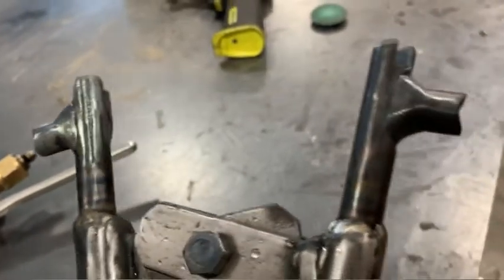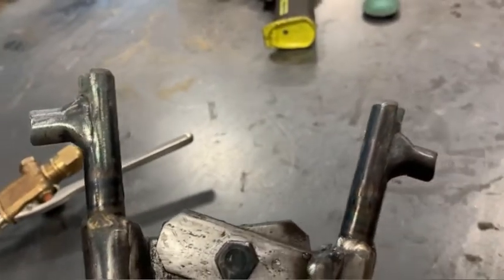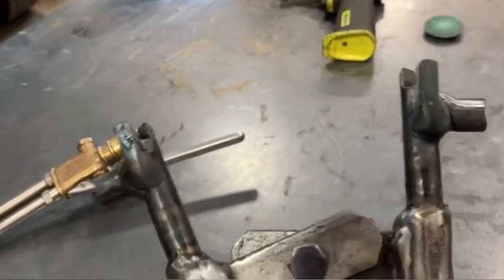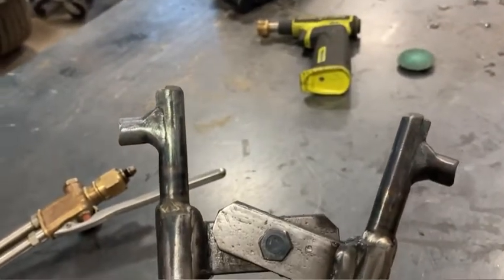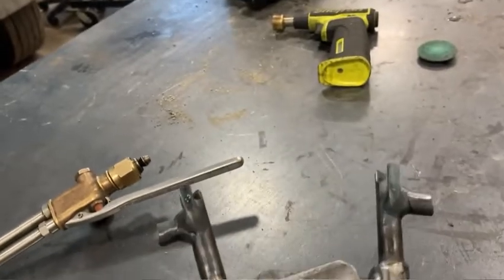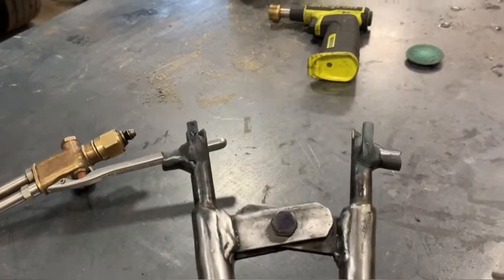Here's what it looks like after you do the tempering - you can see the bluish color. If you got it to the right temperature you'll see that tint of blue, maybe a little more purple. It's hard to do with a thicker chunk of metal heating with a torch because it's uneven heat, so the color will be a little more blue than purple even though purple is the color you want for the right temperature. I've done it before where I heated it, let it turn purple, and it was still too brittle - so there's kind of a fine line there. I'll try to get a later clip of what it looks like in use, but that's what I got for y'all. Stay creative until next time.